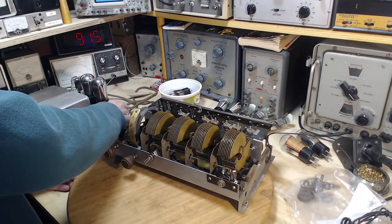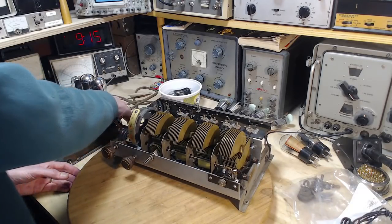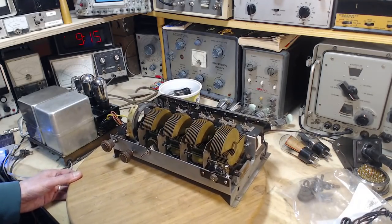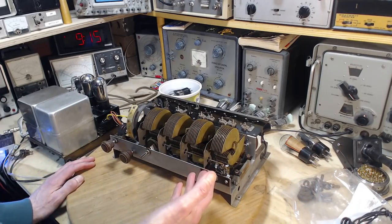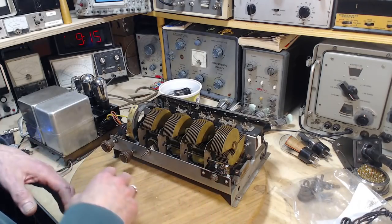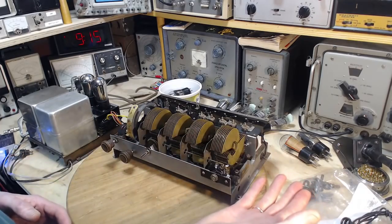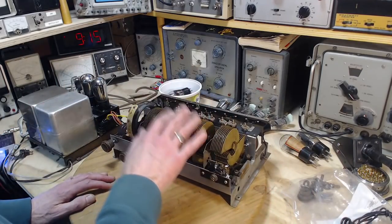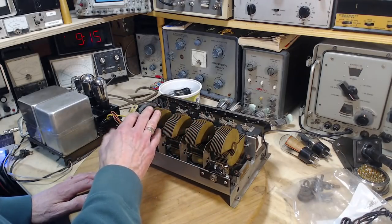This radio is really like 3 or 4 radios in a row, each one's output becoming the input of the next, which is kind of how you would imagine most radios work. But of course, modern radios are frequency shifter radios. They convert the received frequency at the antenna to an internal frequency. They work on a whole different principle from this guy. This guy is real simple. It's like 1, 2, 3, maybe 4 radios.